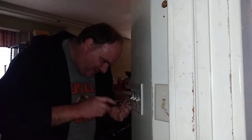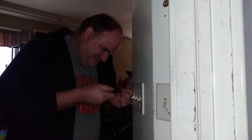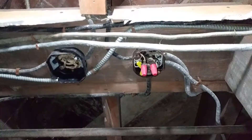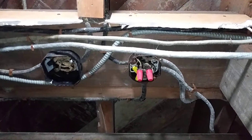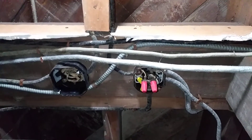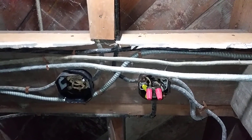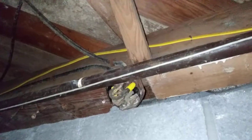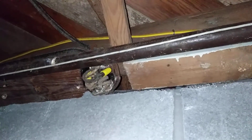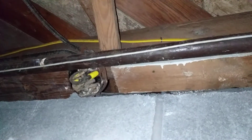My dad always says I wouldn't be able to work without my tongue because it sticks out when I work. That's it, all done. These two boxes — I took some loose wires off the one on the right, put wire nuts on, and that's ready for an extension. The one on the left I just cut back, re-stripped them, and tucked them up in the box. This one needs an extension but the pipe is in the way and the wires are too short. We can't move that pipe because it's a gas pipe, so that's just gonna have to be left as is.